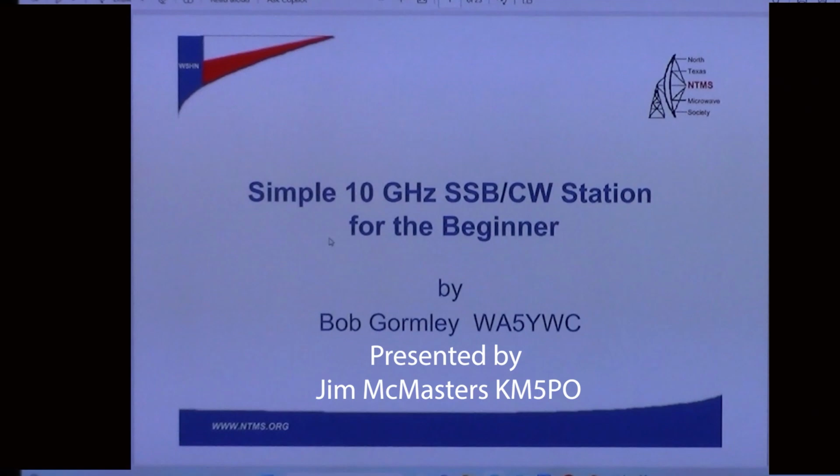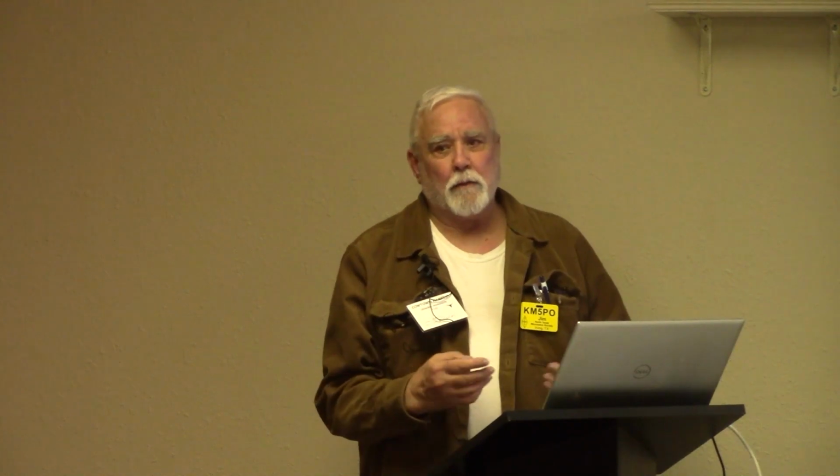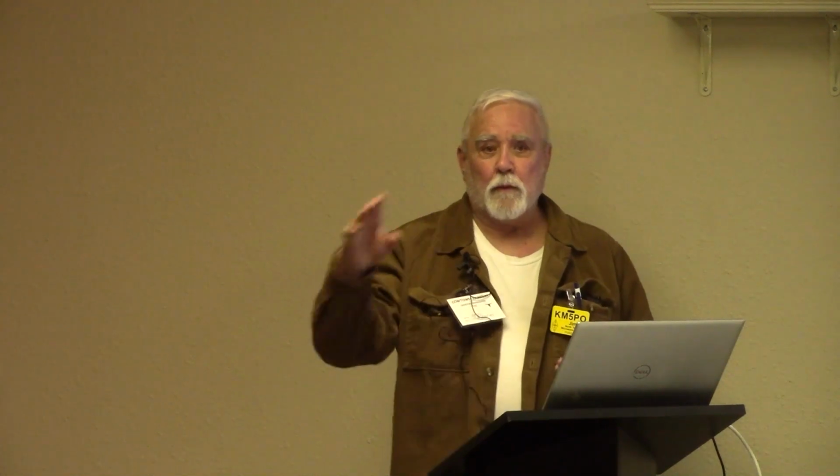We'll talk here about a beginner level 10 gigahertz system, and that's where a lot of folks start when we hear about them, although there are lower bands that we consider to be microwave, such as 900 megahertz, which you heard Kent talk about, so 902, 903. 1296, another one that's very popular, 1.2 gig. 2304, very popular. 3400. Now we've had to change from 3456 down to 3400, then 5670, and then we jump to 10.